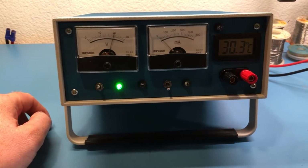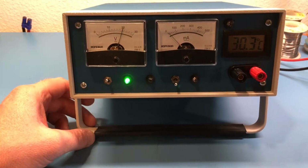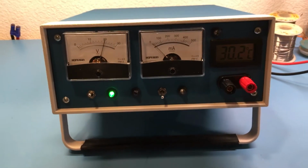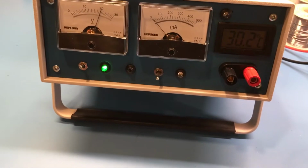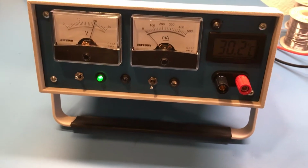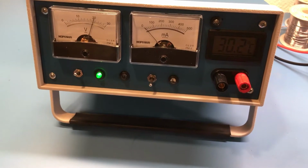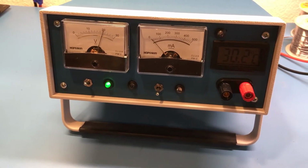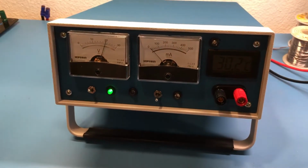So here we have power switch, which turns on the 15 volt regulated DC for the LTZ1000 and the voltage buffer boards. I don't have the 10 volt buffer board built yet. I'm waiting for the VHP resistors from Vishay to arrive. That way I order the correct value resistors for the voltage buffer. I'm going to be using an LT1010 buffer driven by an LTC1150 op amp when the parts arrive from Vishay.